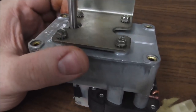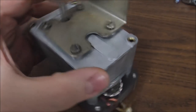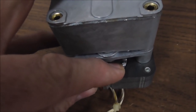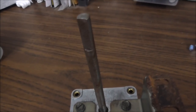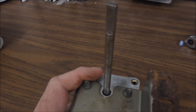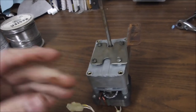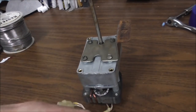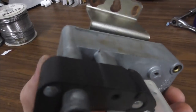This is the motor and gearbox. He said he put a new one on it, but I don't know if the gearbox is new or just the motor. If you look, there's solder all over the rotor — I don't know why it would be like that. If you turn it, you can barely turn it with your hand, and the gearbox is working — it is turning the shaft — but it's just really tough. I checked and there's 50 volts going up to it, so it should be turning. I'm going to clean this up to where I can turn it by hand, then plug it in and see if it turns without anything hooked up. I've seen before where a gearbox that's been sitting for a long time just gets stuck and you need to work it a little.